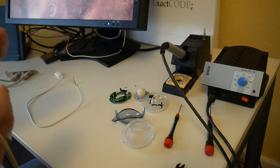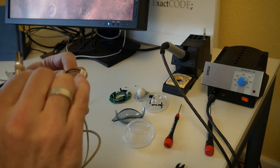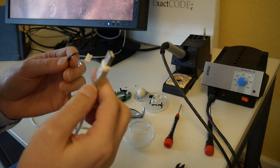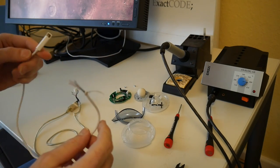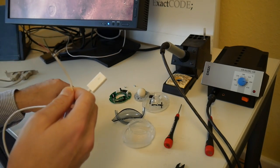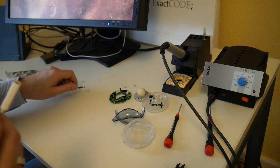And it looks like this original cable is somehow broken because the first pins, this is ground, and the first actual pins, apparently ground and data plus or minus, do not appear to have contact. So maybe this cable just broke, or I don't know what. And as most of the Apple keyboards came with some extension cord, I cut this extension cord in half and will try to solder this to the pins there and see if it works with a new cable. So stay tuned.